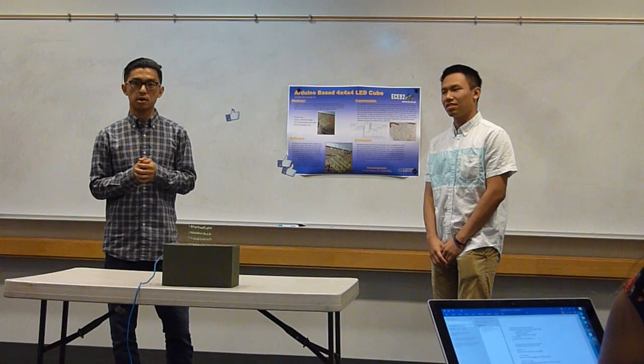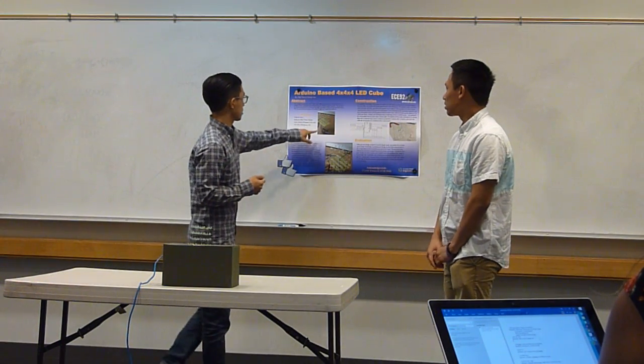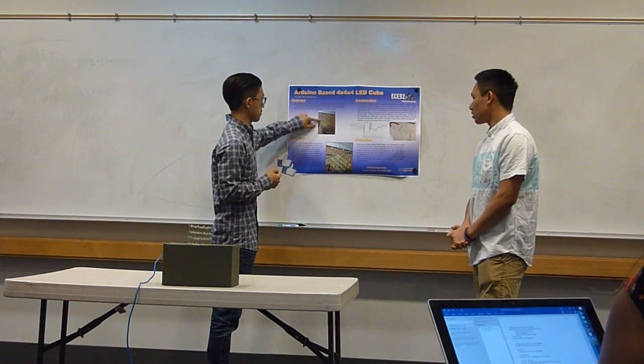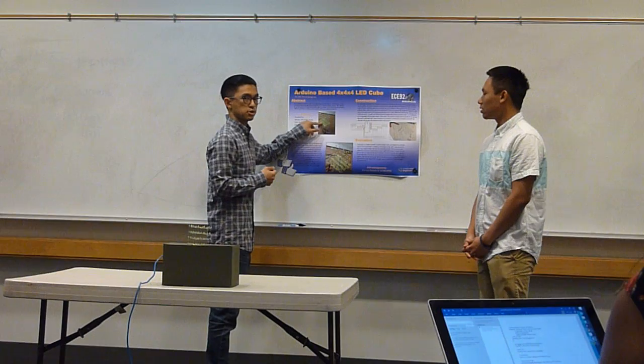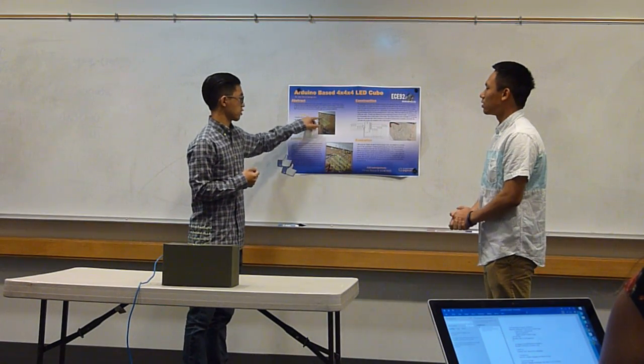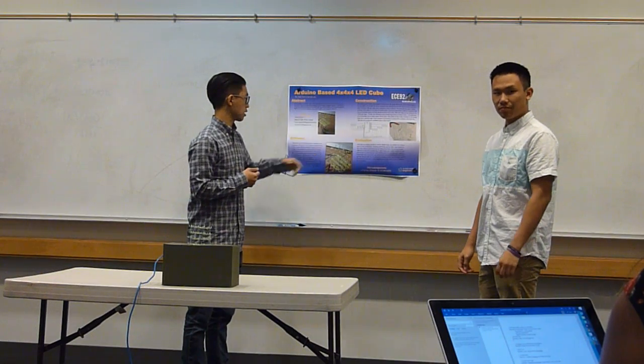We had 16 anode legs, and for our Arduino we used each port to supply power to each column, so that the power was run through the resistor to the anode, and then after going through the LED, it would be grounded by our 4 additional cathode legs that we had initially included.